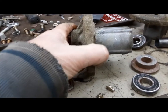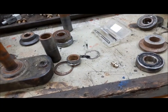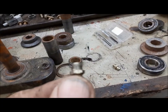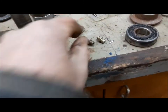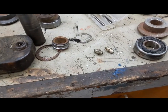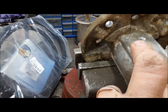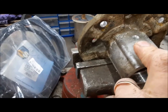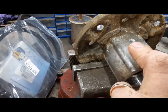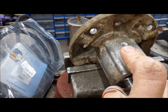Next thing we're going to do is drill and tap the side of each of these for a grease fitting. I think these are 1/16th pipe or something like that, but what I find is that quarter-fine is a nice match for them. I've gone ahead and drilled with a number three drill, which is the correct size for quarter-fine, and countersunk the entry to the hole. Now we're going to run our tap down it, and then our grease fitting should screw right in.